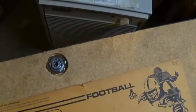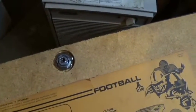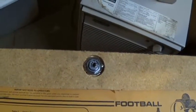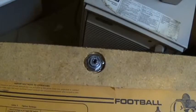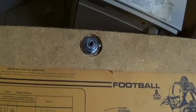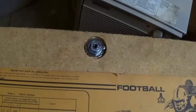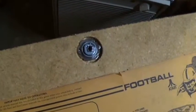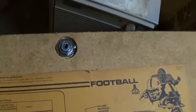to screw into. But I took the metal piece out, cleaned out some shavings from when they, I guess they drilled it out a little bit deeper, I'm guessing, I don't know. But cleaned that out, then gave it just enough room to tighten down the nut around the lock. And then I put the side screws on up above the lock, which is okay because we're not anticipating changing this lock anytime soon.